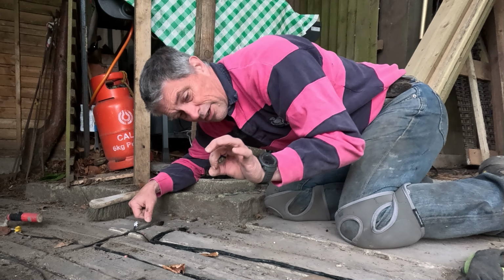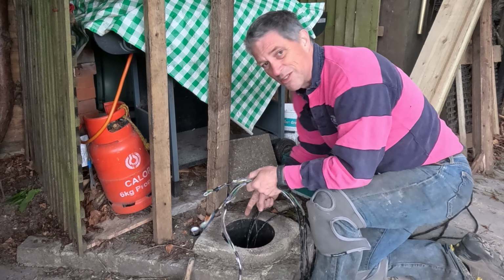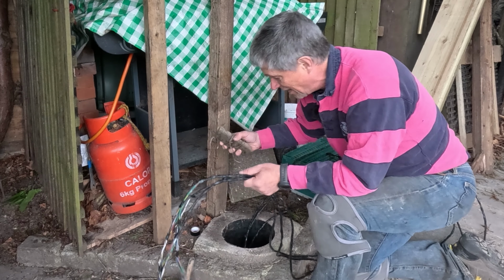That'll be all right. The next phase of this little project is actually very straightforward, because that's a 110mm, 4-inch flexi pipe that very easily will accommodate just these 3 bundles. The trick is though, although I've got a drawstring that goes from here to there, if I use this and pull these cables through, then when I want to draw more in, I don't have a drawstring to pull through. So as I pull this bundle through, I'm going to draw in another string to leave so that I can use that in the future as a drawstring.